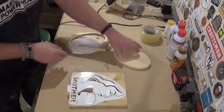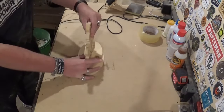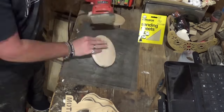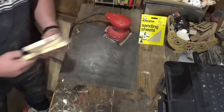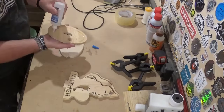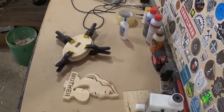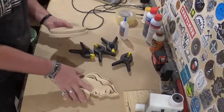Now that all of the scrolling is done, we can move to the workbench and remove the pieces from the waste wood for a first glimpse of how the project looks. Then we go to sanding — I'll sand the front and back of everything with 180 grit Klingspor Woodwork and Shop sandpaper in the vibrating palm sander, being careful with the scroll work so I don't break anything. Then we'll glue the base together first using CA glue and activator, using spring clamps and letting it set up for around five minutes.